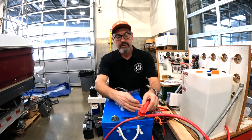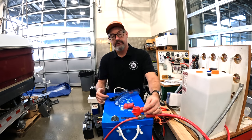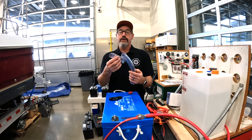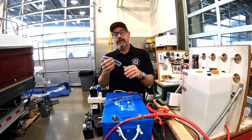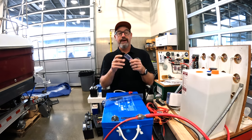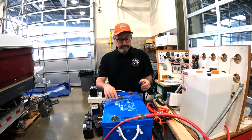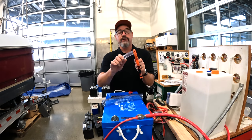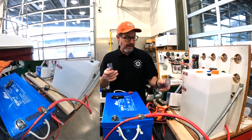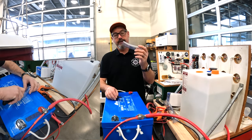If you get your factory boots here, these are kind of difficult to use. They do make one that actually has cables in both ends and covers up, but I couldn't find it in the lab. The tech tip is this: you go to your hardware store and get clear vinyl tubing — which we talk about in our plumbing class as having almost zero use on a boat because it kinks — but this stuff works perfect for protecting the ungrounded terminal or a Class T fuse. You simply measure out how much you need, chop it to length, get the right diameter. We keep inch-and-a-half and one-inch and different sizes on hand. Then all you do is take your box cutter and slice it down.